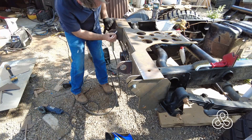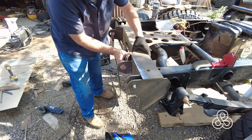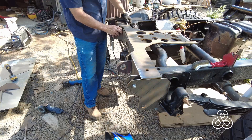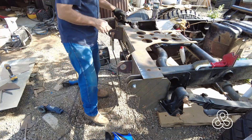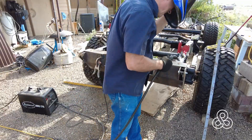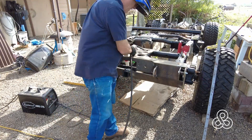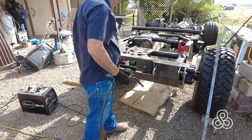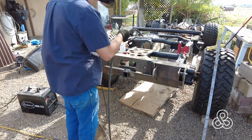Now I'm putting in a couple of end caps — there are a couple of open areas between those two parallel plates. I'm fitting those in there and putting a little mark on them, because I'm going to cut a little slot in there so that once those get tack welded in place I can bend the top of that around over the top of that anchor — that half-inch thick anchor plate that sticks out there. So we've got all these pieces in place, get it tack welded up, get ready for the final assembly. That little slot's been cut in the end cap, tack it in place, and that little piece will bend right over the top of that half-inch thick anchor point.